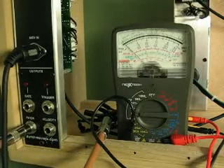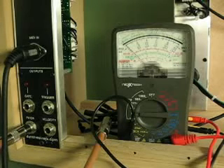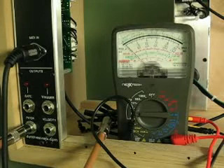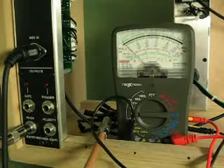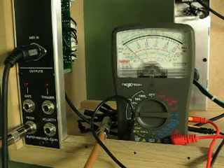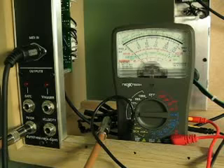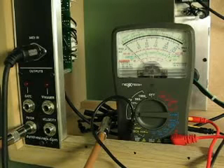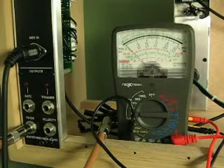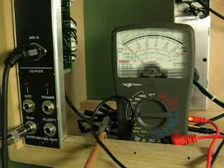I am now going to play some notes. When I play a note, you should see the gate trigger light LED flicker, and the gate LED stay on for the duration of the note. What I'm going to do is play just C across several octaves, because that falls right on the volt boundaries of the 5-volt range. And then I will play up and down a scale within an octave. So here we go.